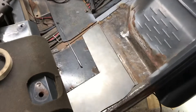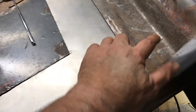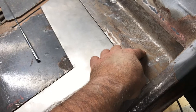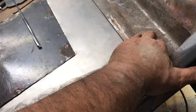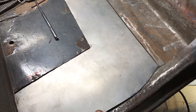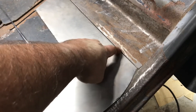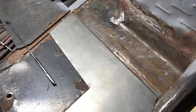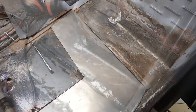We've got the piece in and it's looking good, starting to get some welds on there. The reason why this side looks different than that one is I laid it out on the good side, which ended up being on the inner side - the good side being the nice shiny side of the steel, while the back side had a little surface rust. That's why they look different, but they are from the same sheet of 18-gauge steel. I probably should have gone with 16 gauge or something, but I think it's going to work out just fine. By the time I put some welds on there, she'll look awesome and sturdy.